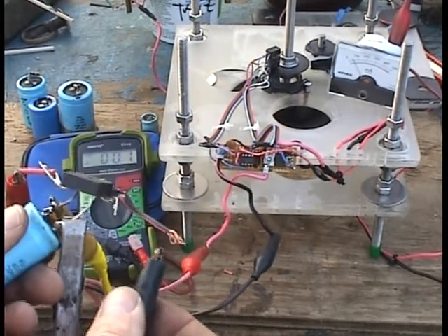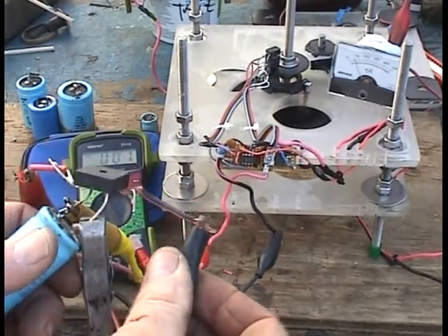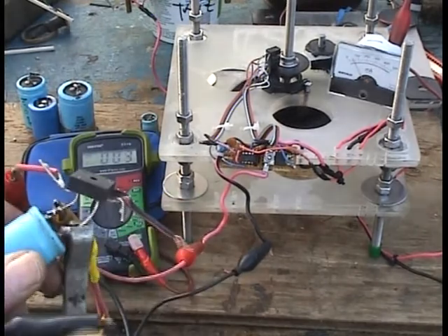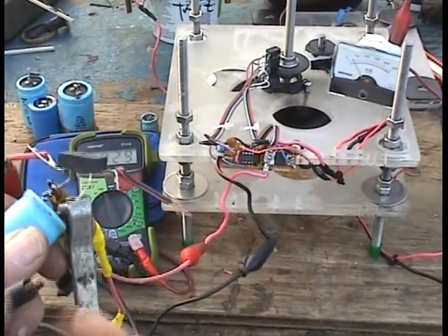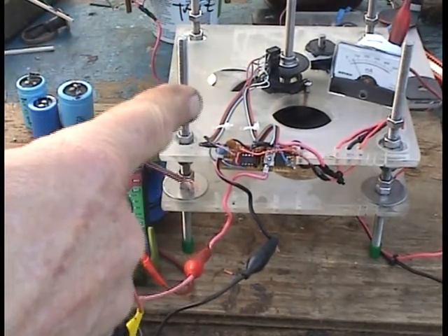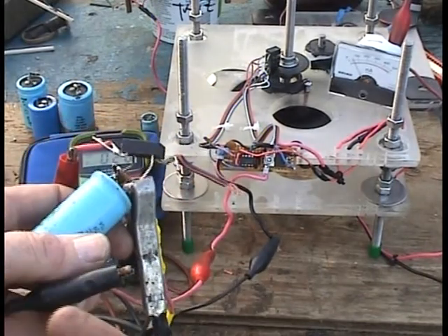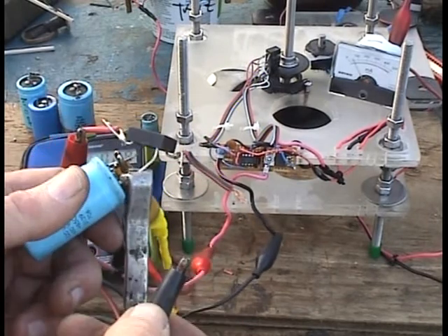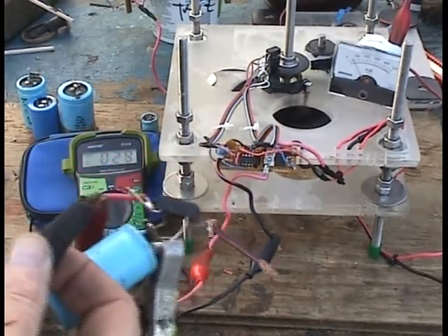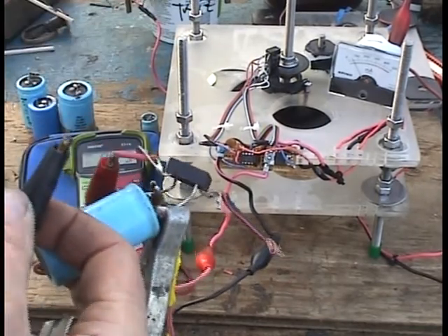There's also the time you collect and how many pulses. When I do it this long, it goes up to 60. If I do it just that long, it's only up to 29. There are eight pulses per revolution. Every time the pulse turns off, it creates that back EMF recoil. You have to decide how many pulses you want to collect and then how many times you want to discharge — after each one, or maybe wait after four.